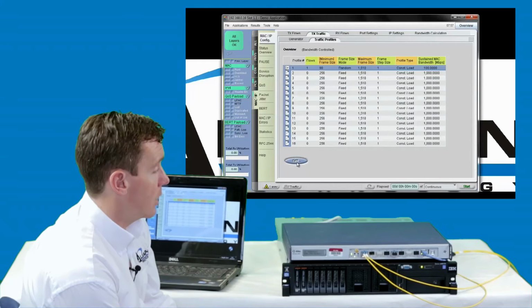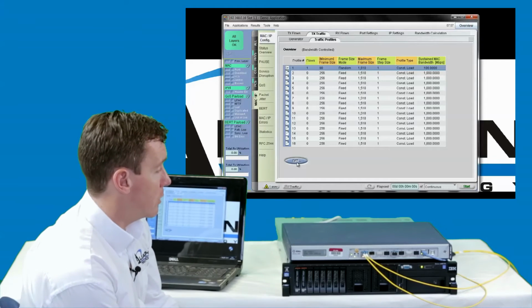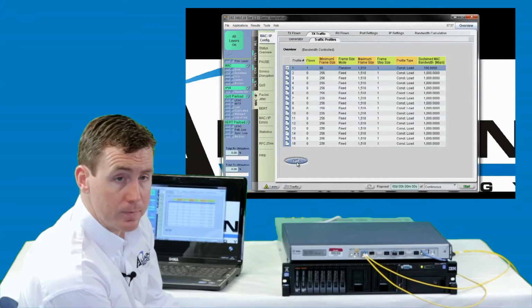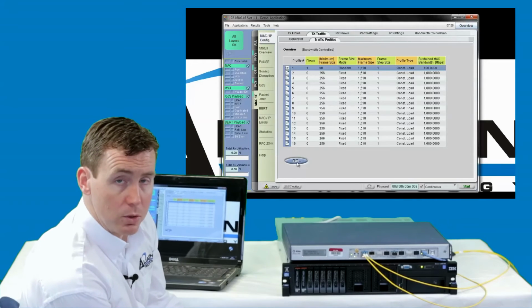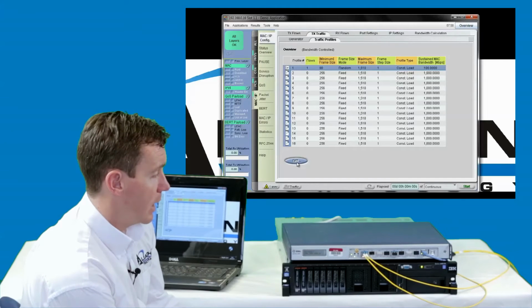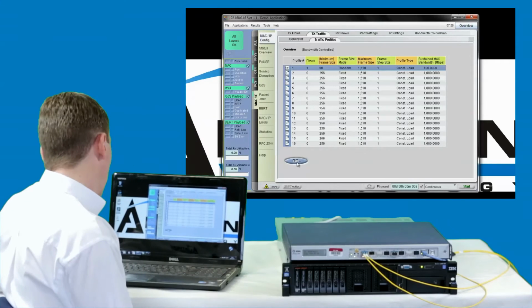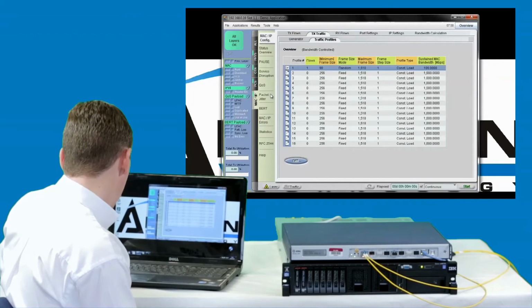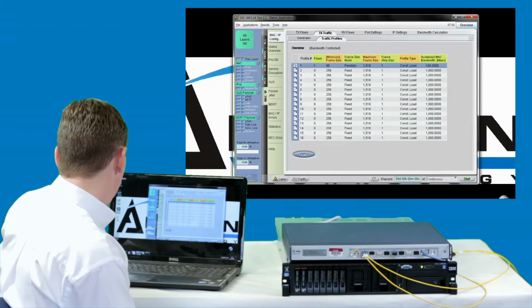The design on the FPGA can capture everything at wire speed. However, the Wireshark application layer, which is software based, would really struggle to process 10 gigabits worth of frames in a reasonable time for a demonstration video. So we'll leave that at 100 meg, and that's our traffic setup.